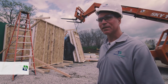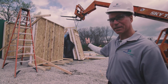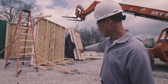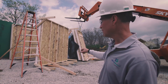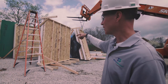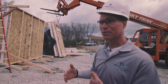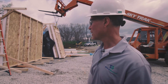Once you take the protective layer off the panel packages, this is essentially what you'll see. This had four panels deep in the package. They've unpackaged and utilized some panels already on the job site, but it has all the stand-ups and skids so you can forklift everything around the job site. Everything's braced within the package so panels can stand on their own. All the windows and doors are protected within the internal part of the packaging, and you pull them off in the optimized order and place the panels on your job site.